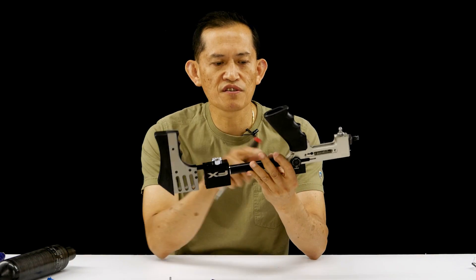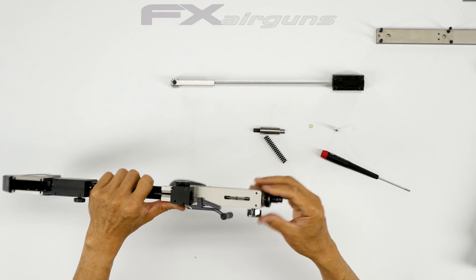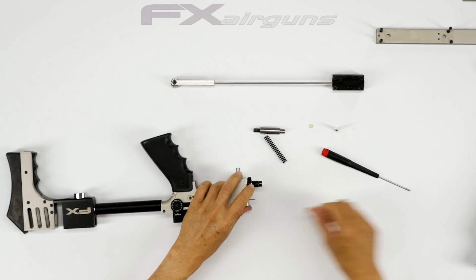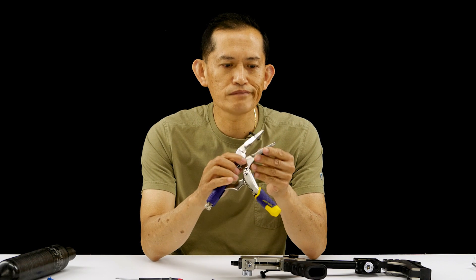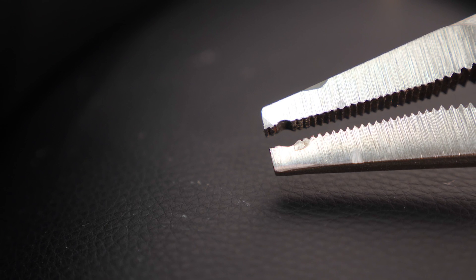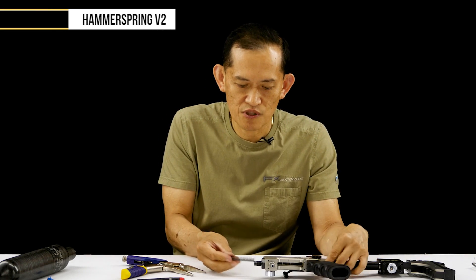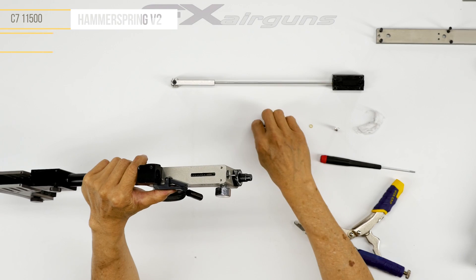Since this section is already sealed and I don't want to break that seal, I'm just going to pull the valve rod out. Since there's no pressure, I can pull it out. The tool I'm going to use is a modified vice grip — I've honed a half-moon groove on it so it's really smooth and doesn't gouge up the rod.